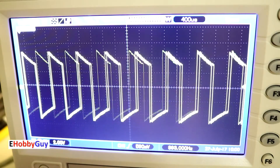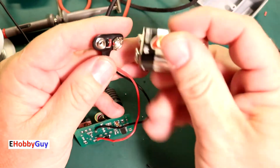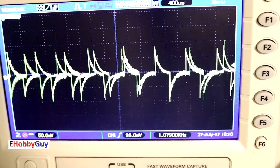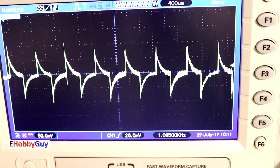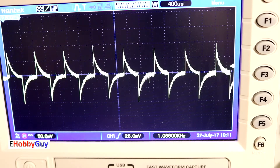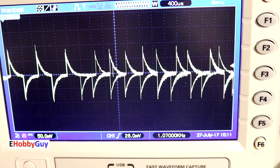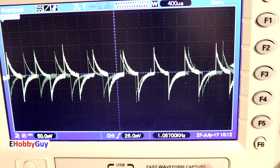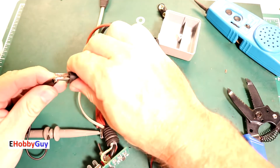Here is the new battery connector; this is the old questionable one. Plugging power back in and hooking the scope back up — we are back and the waveform is the same as before. I am moving the battery now and I have total stability in the waveform. Moving it around without being too aggressive, the flickering and power loss appear to be gone. I think there was a defective battery cable, possibly combined with corrosion damage. The frequency is shifting from about 1 kHz to about 1.25 kHz, but we have stability. Let's put it back together.